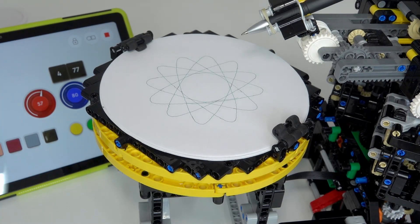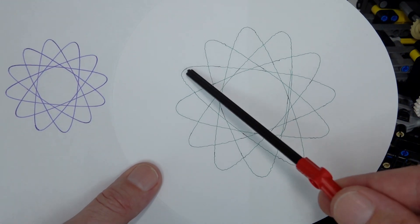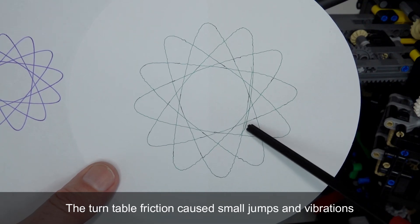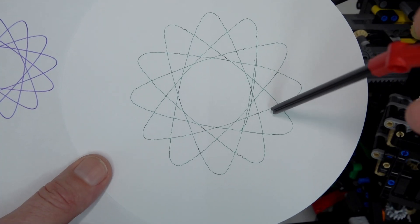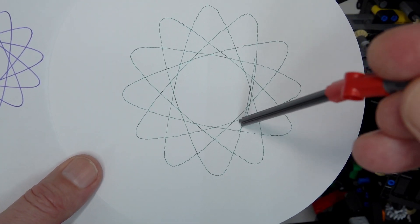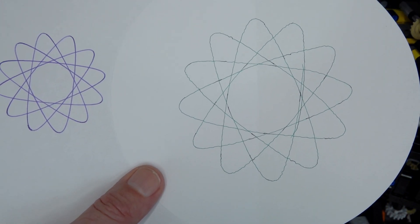Look at that — the end. This is a comparison between the original SpiroGraph and my SpiroGraph machine. You can see a little bit of wobble in the lines, which I think is due to some small friction problems within the gears. The start and finish don't quite line up either — when the pen drops onto the paper it can slide a little because of the angle of the pen as it moves down. But overall, it's a great comparison — they're pretty much almost identical apart from the scale.